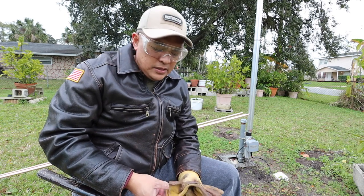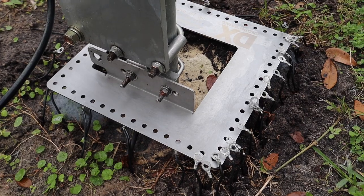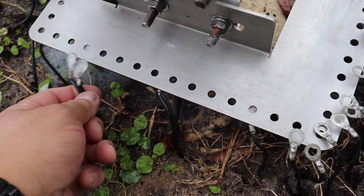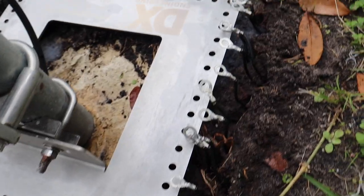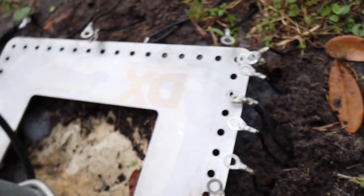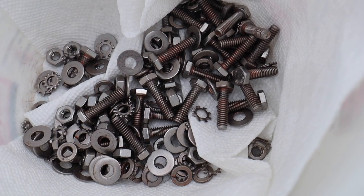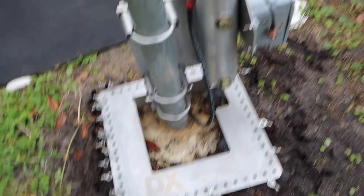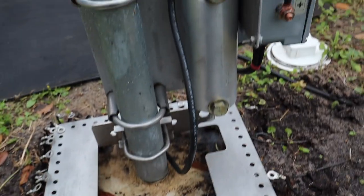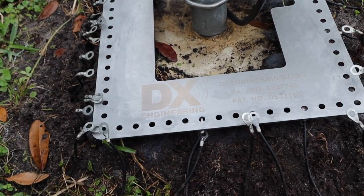Alright guys, I'm ready to pound. I got my hammer, got my safety goggles, got some gloves. I did a little bit of antenna maintenance. I cleaned the grounding plate using Dawn detergent and steel wool to sand it down. And there's my nuts and bolts, star washers, and lock washers. I'm going to put these grounding rods closer to the plate and attach it to each of the three remaining corners.